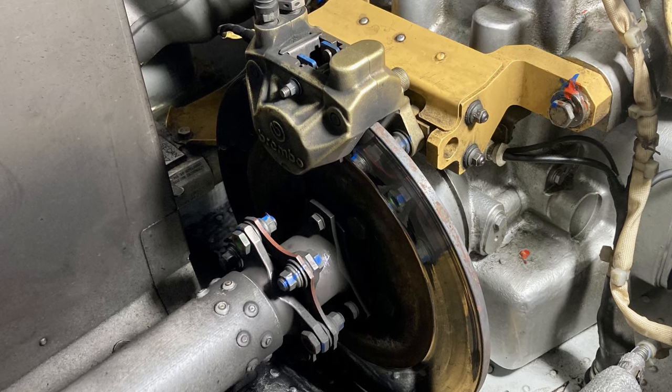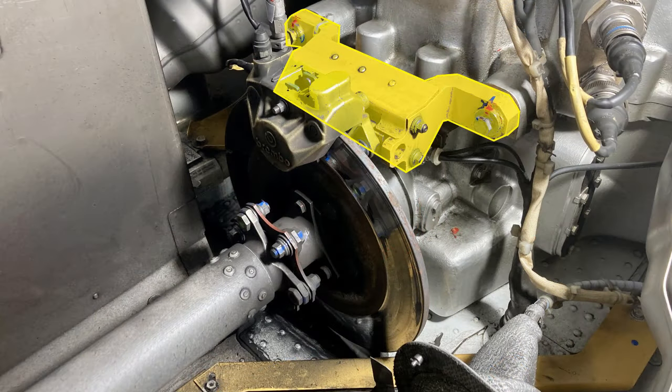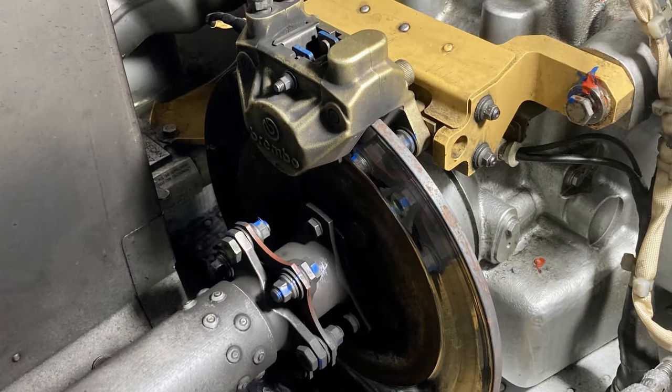What we're going to go over is we're going to disconnect the front of the front tail rotor drive shaft. We're going to remove the coupling flange. We're going to go over how to remove the brake caliper, the simplified version, because their manual isn't super clear. We're going to reinstall everything, and after you do that, you're going to have to shim the caliper to the new rotor. After you do that, you're going to have to replace the rotor brake pucks or linings.